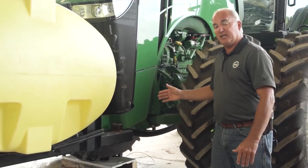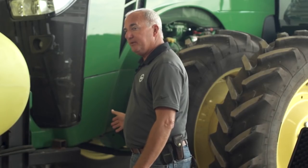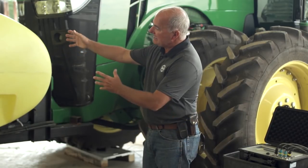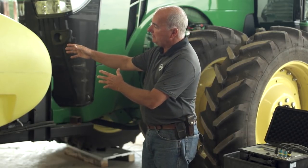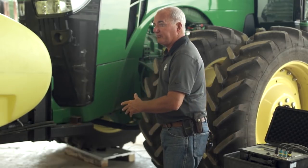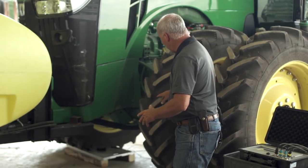Obviously, it's going to increase the front axle load, and all of us have had the experience. I've had them myself, and you get in wet conditions, and all of a sudden it becomes very much a detriment because we've taken weight off the rear axle. So yes, there's an advantage as far as it's easy and simple to mount, but the disadvantages start to come down to yield itself. And we talk about pinch rows of that much weight on this front axle.